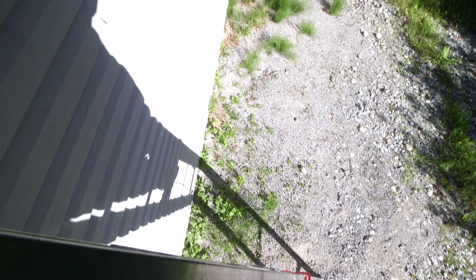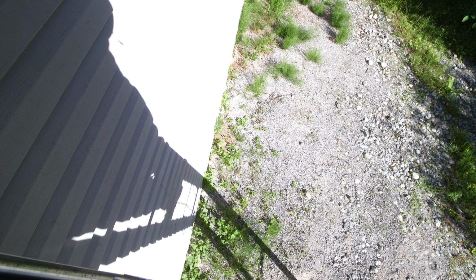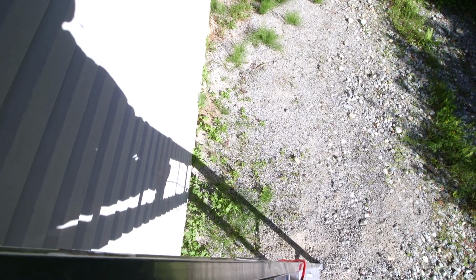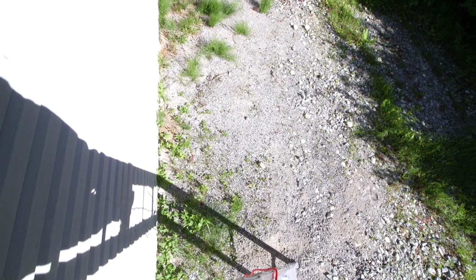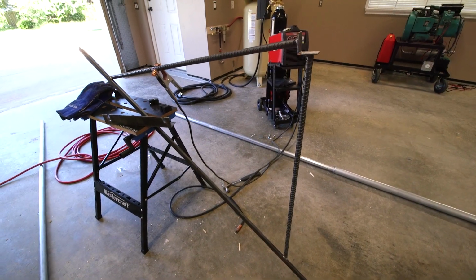And then after that's done, what I can do is set the mast up. So I have a short piece of mast. I've only welded two pieces together on one chunk of mast, because once you put two or three, maybe even four, I'd say two's the limit. With three, the bottom starts to kick out when you prop it up because there's just so much mast hanging out the opposite direction. So I'll stand that mast up, and then I can get everything square and make sure it's straight up and down. And at that point, I can mark down there where I'm going to start making the bracketry for the bottom with a hinge.